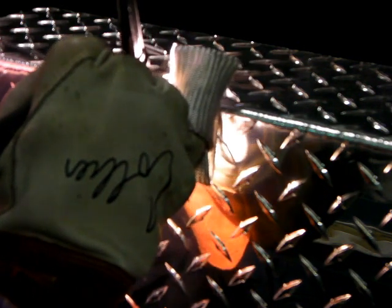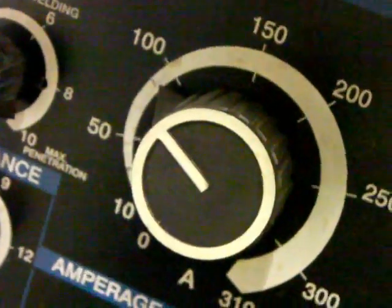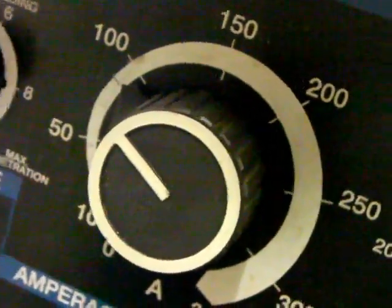Need more amps. 80% helium is what I used here. I use it pre-mixed out of a bottle, but I've also used half and half mixed together and experimented. It's not a precision operation — you get a lot of benefit even when you start adding as little as 20 or 30% helium.